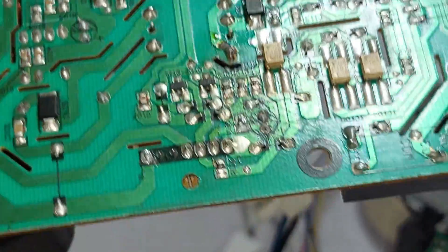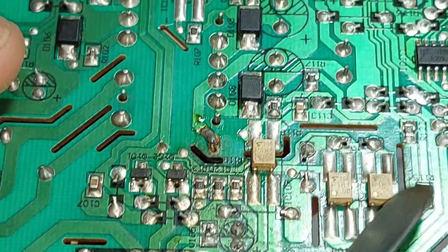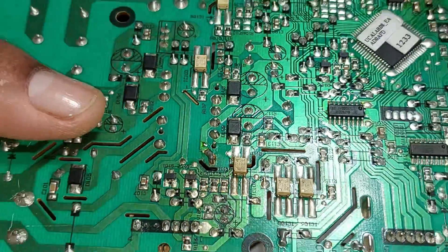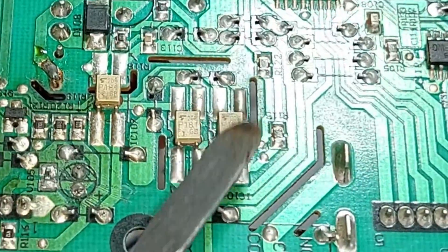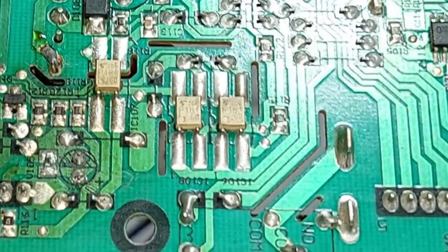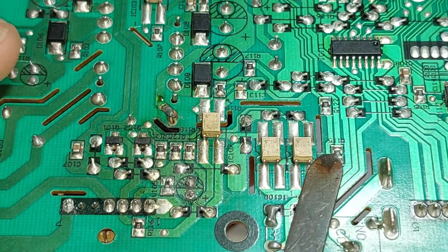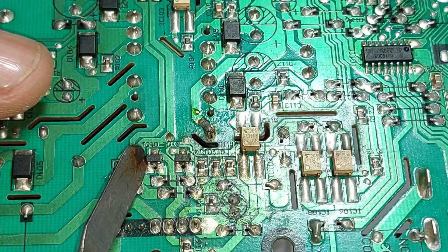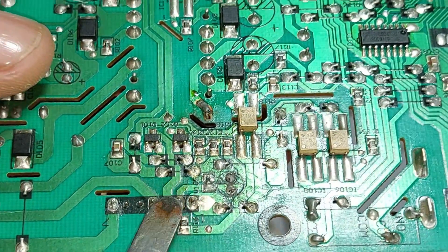One safety circuit is also made here. This is a PNP transistor, but the microcontroller does not control it directly. The microcontroller sends signals first to the optocoupler mounted here to turn on the PNP transistor, meaning high and low voltages are isolated from one another. This optocoupler on the right turns on the PNP transistor on the left, and then the 15 volts pass through pin number 3.